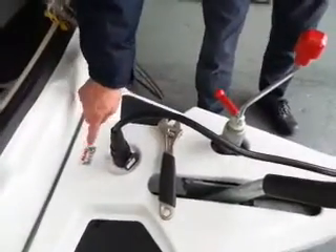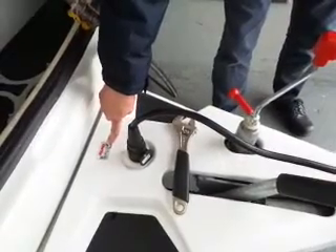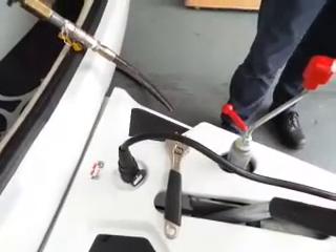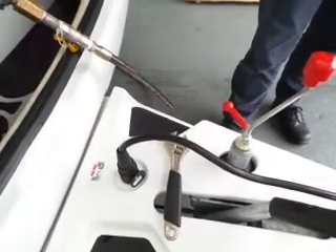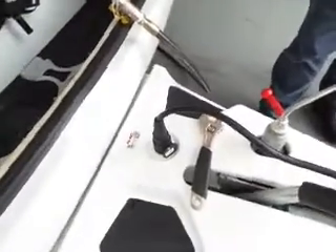Well, you could listen and be told, though. Well, this is it, but you're not saying anything. If you want me to tell you, I'll tell you. Right, so when you connect to your electrics, which is obviously off your vehicle, the system will do a self-test. Normally you will get a green solid light or a green flashing light. Green solid light means it's done its full test. If it's green flashing, it hasn't quite finished its test.